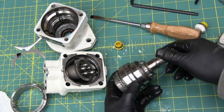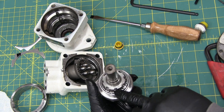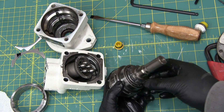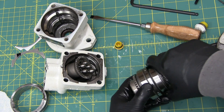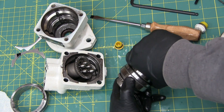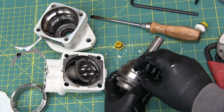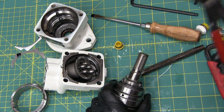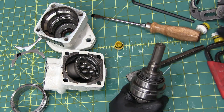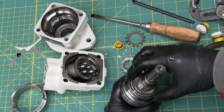This output shaft is beautifully machined — everything is just perfect. So what we'll do — this has a castellated nut and a castellated retention washer. We will knock that down. What that does is it preloads these tapered roller bearings. The preload on there is quite tight — I can't turn that with my hand and it was quite snug even in the bore. So I'll loosen this nut off and then we'll split that and see how all this works. We'll just get in there with everybody's favorite libation. It shouldn't be tight — not tight because it's just preloading those tapered roller bearings. And there's the retention washer.